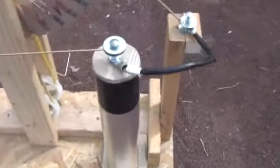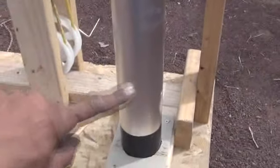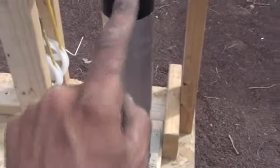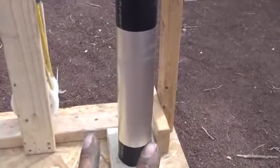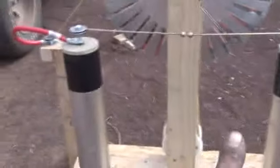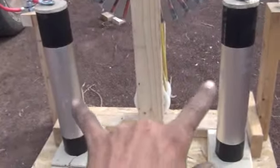What I've done for building capacitors here is I've got a three-inch diameter piece of black PVC pipe, and this is an entire sheet's width of aluminum foil wrapped all the way around the inside and the outside of this PVC pipe, and that's on both sides. Absolutely do not build capacitors this big if you're going to attempt this at home. Just a single one of these capacitors at this size — you may not think it — but just that little bit of aluminum foil fully charged will lay you out. It could obviously even kill you. The two of them combined, that's a dangerous combination.